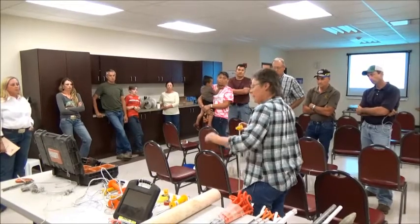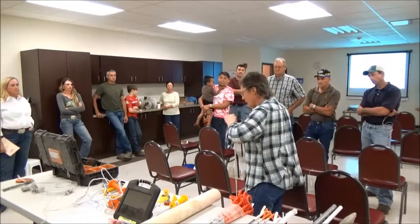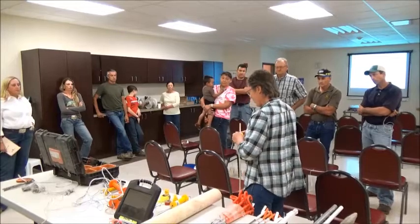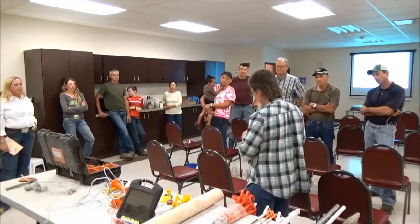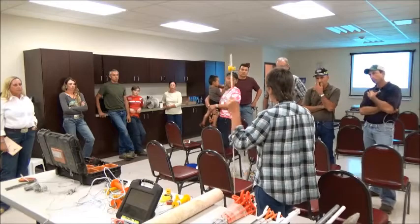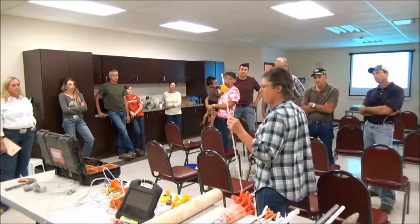Because why? Because when you're going along hooking up the twine, you don't want to have to think, do I hook it up this way or do I hook it up this way? So always put your insulators on in the same direction. Now you say, but Mickey, if you turn them around, you'll still have a problem. That's true. But you want to be consistent. This is the number one typical, most common thing ever used in electric fencing, a fiber rod post.